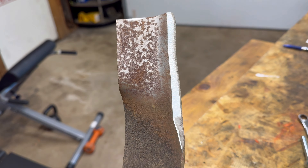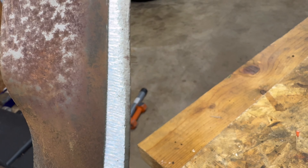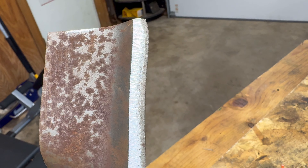Alright, let's see — oh my gosh, that was just two swipes. I can see the angle's pretty good. I'm gonna adjust it a little harsher to the right because on the edge it's not quite getting all the way to the edge. So I've made the adjustment — I've moved it to 40 degrees. Let's do another sharpening and see how she does.